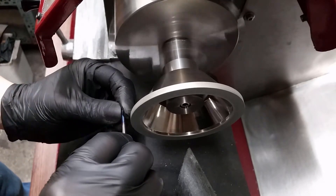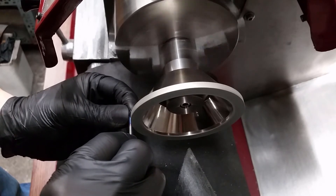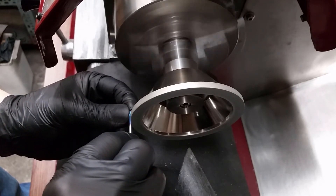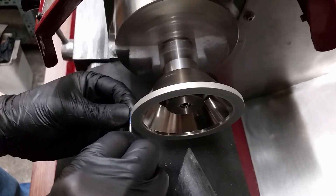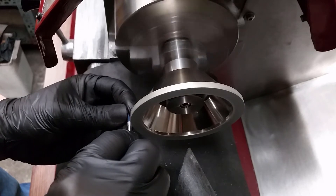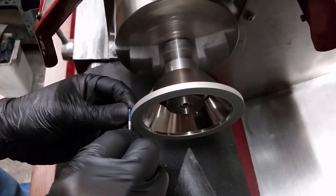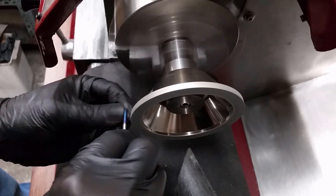This should be the end of this project, but even before trying them out I wanted to modify them. The shaft of the boring bars needed a little more relief to achieve a greater boring depth. Not the best idea to reduce the material and increase the stick out on these small boring bars, but sometimes you just need a few millimeters extra and I wanted to have them.